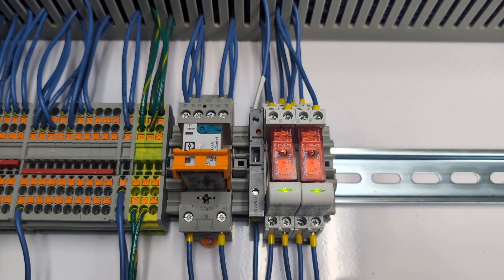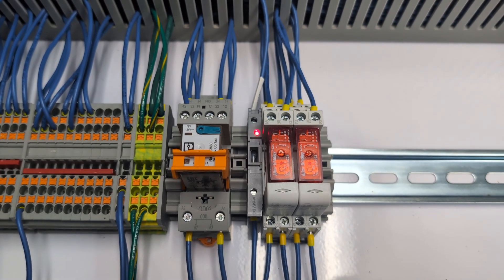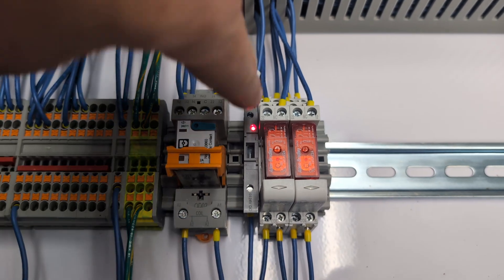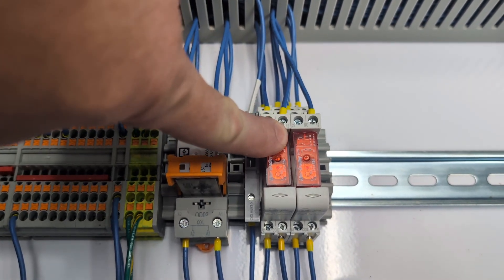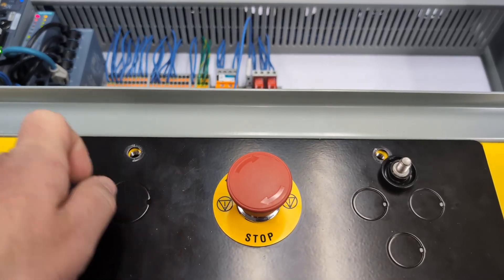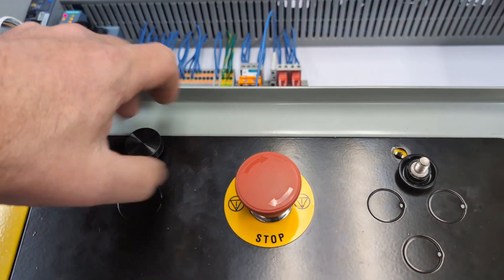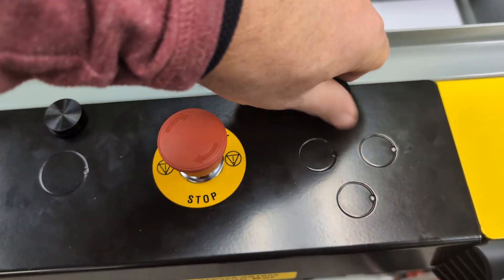When we simulate a fuse breaking it also gives them a blown fuse indicator — gives a little trail of where to go. Then we can talk about things that can be interrupted in an output circuit, mainly our safeties and some type of circuit protection. Very similar to the panel latches from earlier: if you're going to have something they need to take off all the time, put a couple of thumb screws in there — make it a little easier so we can keep on troubleshooting.